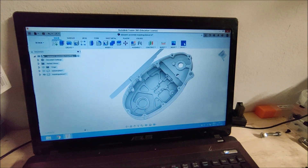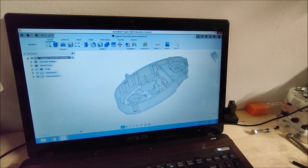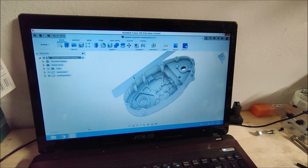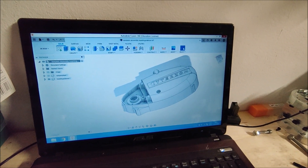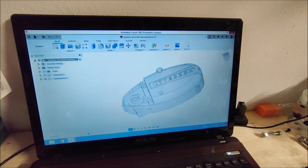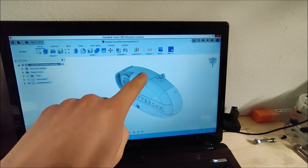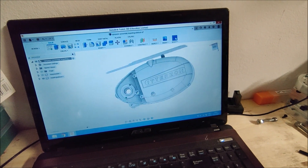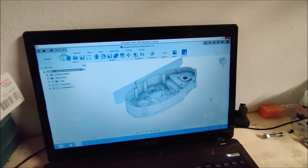The 5-speed has an extra bearing which supports the end of the crankshaft. This is additional from the previous one I made and I added some ribs for reinforcement. After that I will bolt it to the fixture plate and then I can machine the outside, put in the name again, and then I have to do some rest machining - machine the hole where the clutch shaft goes through and where the clutch cable will mount. It's another interesting part to make, so first this side to get rid of most of the material and get all the critical features inside.